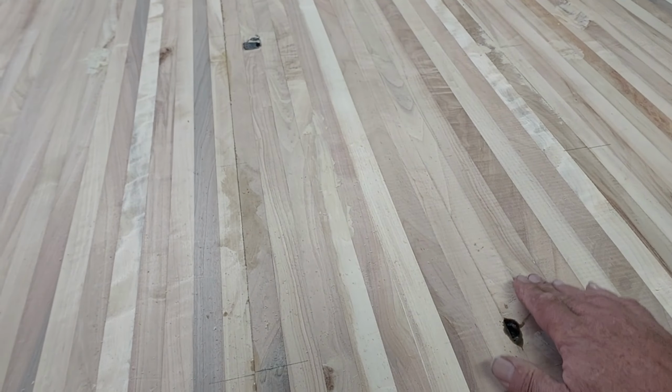So guys, a very handy thing to use. I made myself some clamping cauls and clamp each of them with one clamp, and I've put sanding paper on the back of them. And then you pull on the 45, and that closes the gap quite nicely, and it's nice and 90 degrees. So that's now the clamping done, both sides is done. We'll leave this now for a few hours to dry, and we start sanding again.